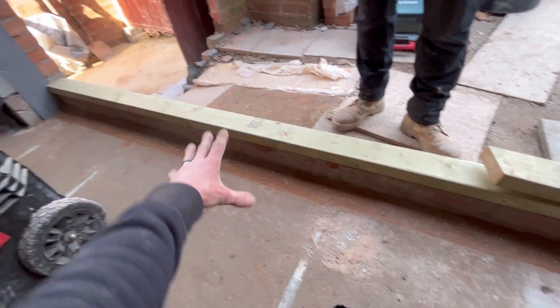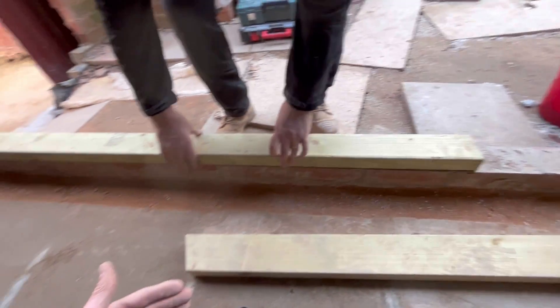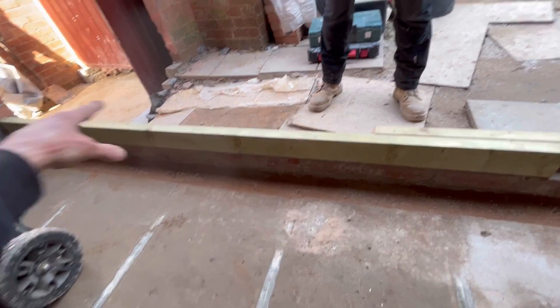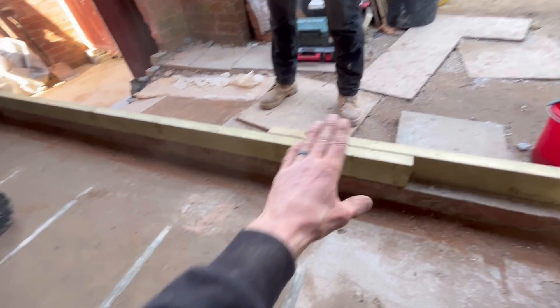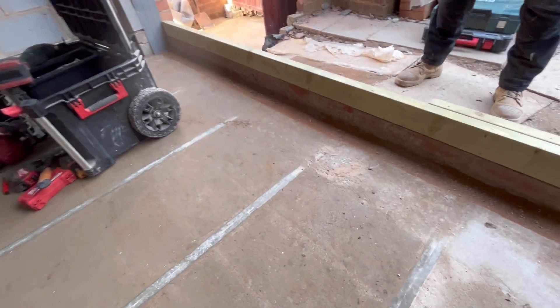We've got this section one brick lower so we haven't got a high threshold, so we're going to cut some pieces of timber in there. We'll up-end the timber and sit it on the inside of the brick, the DPM will go in there with a strap on the back screwed together, just wedged in. We can put a bit of bracing off that if needed. The DPM runs up the face of the timber, then once he screeds level across there we'll just take the timber off and the doors go against the inside of it. Right, one final sweep and then we'll start putting the DPM down.